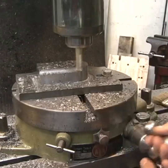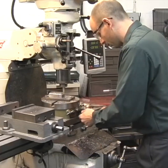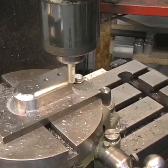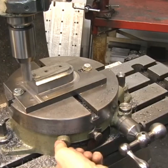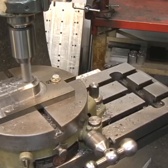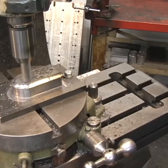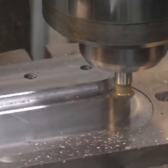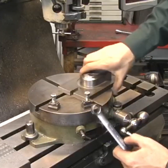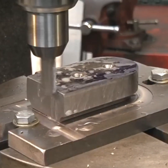I'm going to change to a ball mill just to add a little artistic detail on the top of the part. I make two passes — one roughing pass and one finishing pass — using the same tool. Then using an end mill I clean up the very top surface. A little 45-degree chamfering tool adds some of the craftsman's touch. Now the top of the part's done, and I'm going to remove it and remount it to work on the bottom side. Here I'm using an end mill to make a little relief cut on the bottom side of the base.